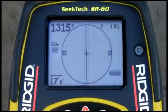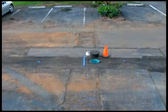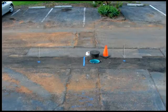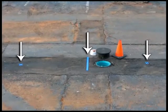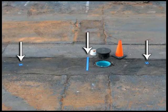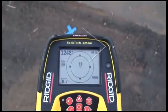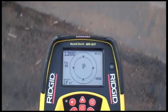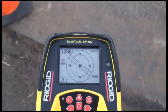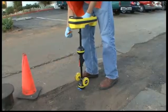The SR-60's display contains icons that represent the position of the poles and the equator. To map out the sonde's position, we'll locate and mark the two poles and then locate the equator between them. To make it easier to see, we've pre-marked the position of the two poles and the equator. When you get close to the sonde, the receiver will display the location of the closest pole. We'll simply move the receiver until the pole icon is centered on the crosshair, then mark its position using the marker chips included with the receiver.